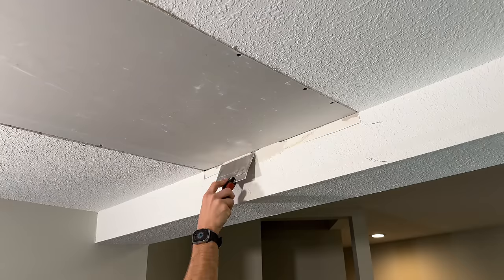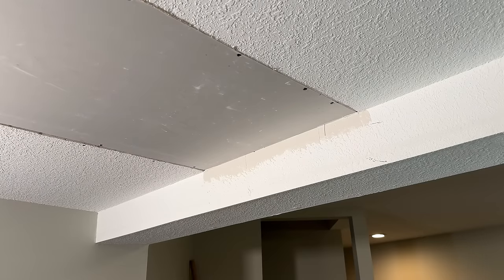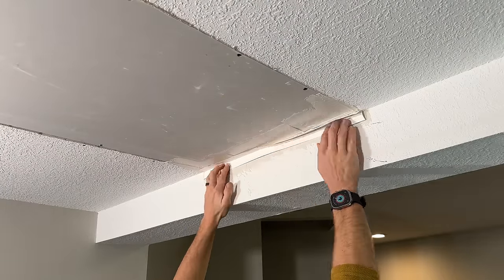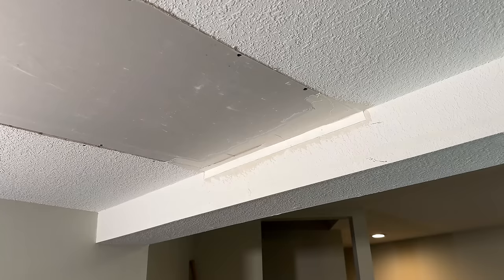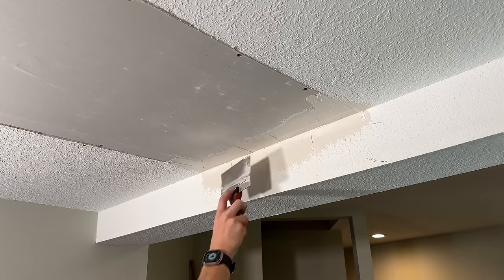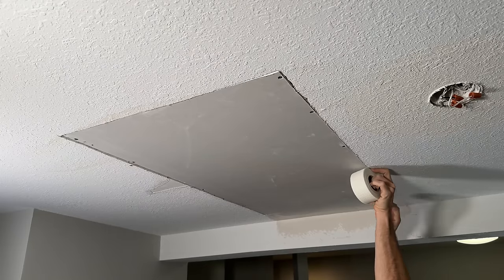Kicking things off, apply a little all-purpose joint compound to the inside corner — hopefully you don't have to do an inside corner, but if you do it's not the end of the world. Apply a light coat filling in the gaps, then take a piece of standard drywall tape, use the crease in the middle to position it, flatten it out, and apply a light layer on top of the tape to smooth things out. For this first application, go as light as possible to avoid needing to sand before the next coat.